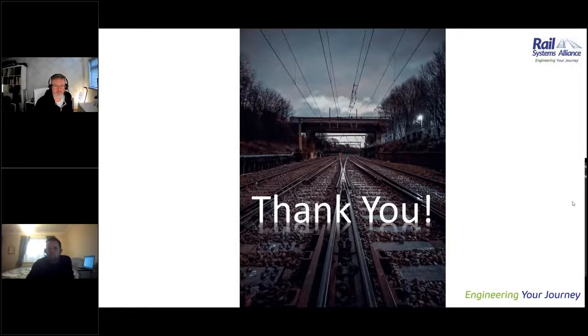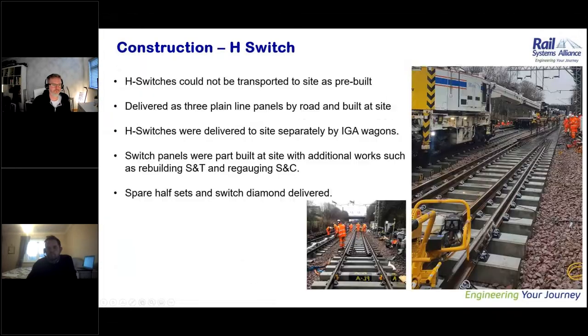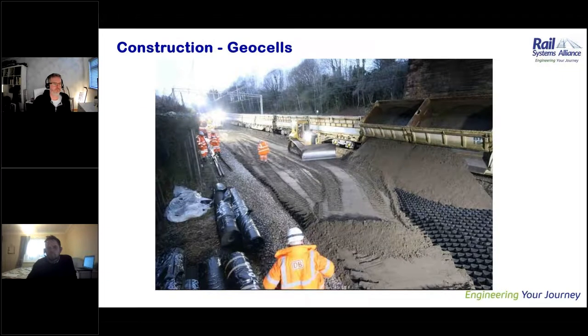No, the sand infill came from Paul Coyne, who was the lead engineer on the site. He'd actually done something similar down south, near Coventry, I think it was. And that was why the slide that Sathish had with the side tipping proved to be quite fruitful. So rather than have excavators try to push out and load sand as we normally would on a normal site, the methodology of just dumping the sand and then pushing it with the dozer was the best methodology. There wasn't any issues with crushing, and we had spoken to the manufacturer of the actual geocell.